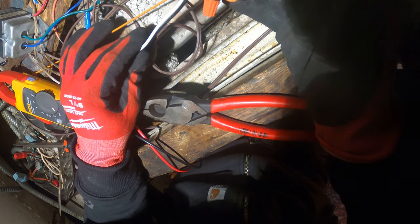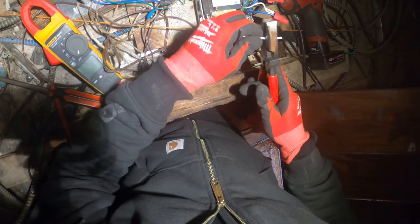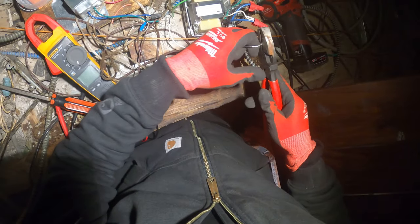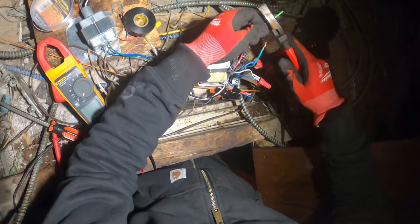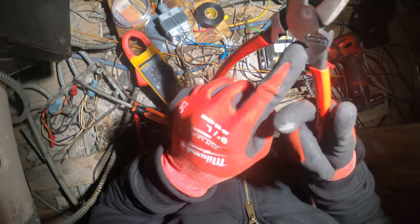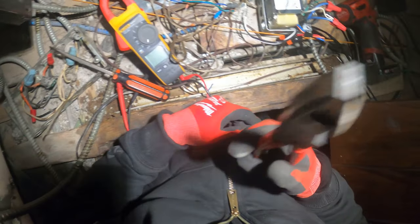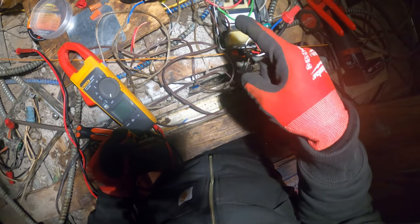Alright, so I capped off each lead, put a wire nut on them, taped that, and just isolated these to make things a little more clear. So we're going to strip back our wires and connect our primary and secondary because now we are ready to go. This Knipex tool is so good — it strips wire so fast and easy. These linesman pliers are awesome, they also have crimpers — super lightweight and comfortable. Let's get this configured. Here's our secondary and here's our primary. I'm now connected, I'm going to flip the switch and check for voltage and see if we get our 24 volts.